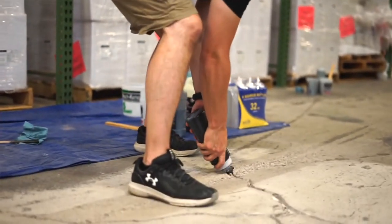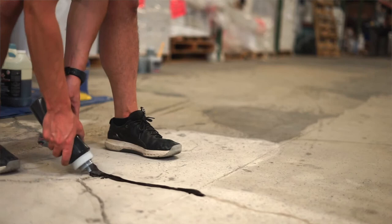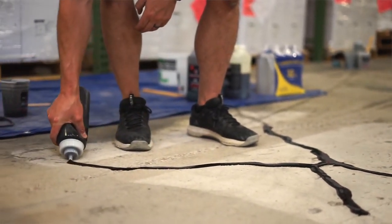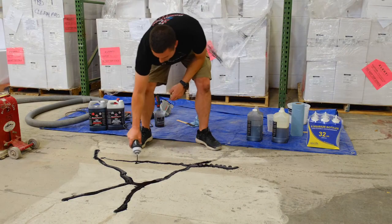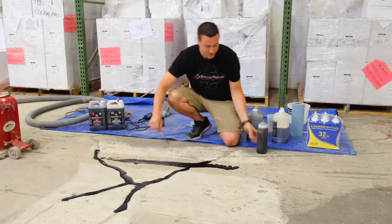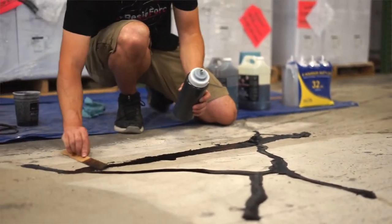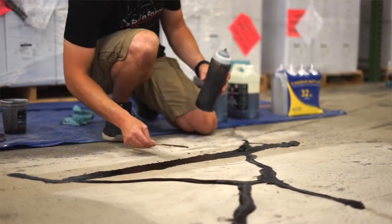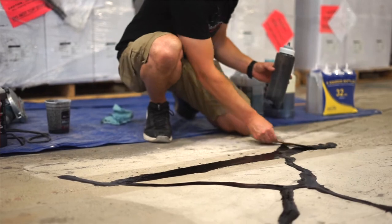I'm going to pour this into the condiment bottle and fill in the joint or crack here. Just slightly overfill it — if you overfill it too much, you're just going to have to grind that much more away. When you get to a spalled area, fill it in and even it out a little bit. You can use a hand trowel or a stick, whatever you want, and just make it flush. You have about six minutes to work with this, so it's real easy to use. You can form it, trowel it, repair aprons — you could even use it for cove if you really wanted to.